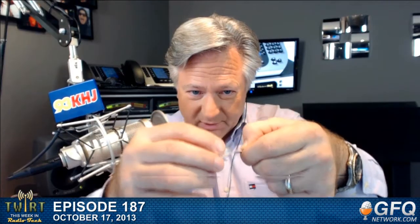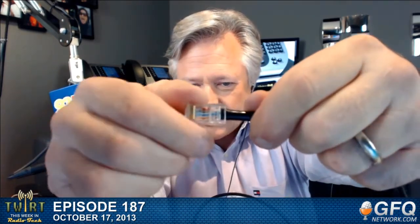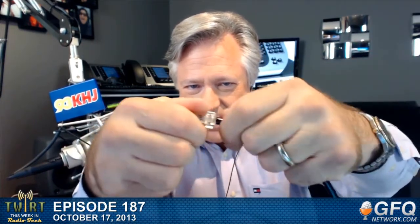Now I'm going to shove them in here. I'm going to just let go and shove them in. And there are guides in the RJ connector that help guide each wire. So as long as you're holding them flat, they'll make their way into the right place. Now, it's certainly a good idea to visually look in there. And if you have to use your old man reading glasses to make sure they're right, do so. And then you see how I've got the jacket partially pushed in there. I give it a good push, get the jacket up in there.